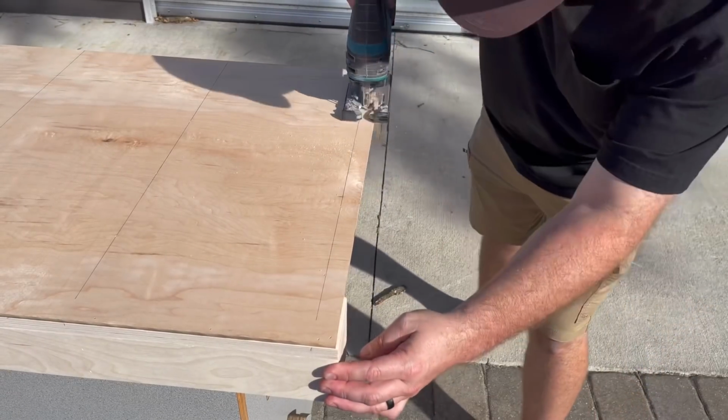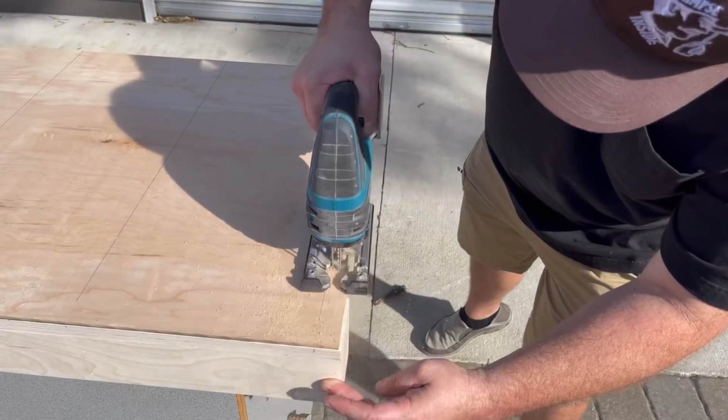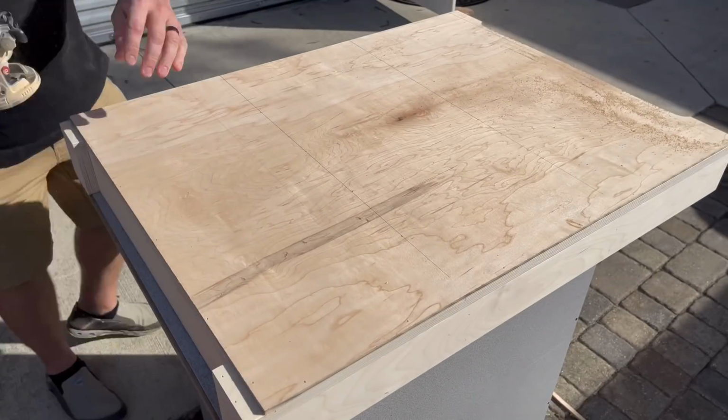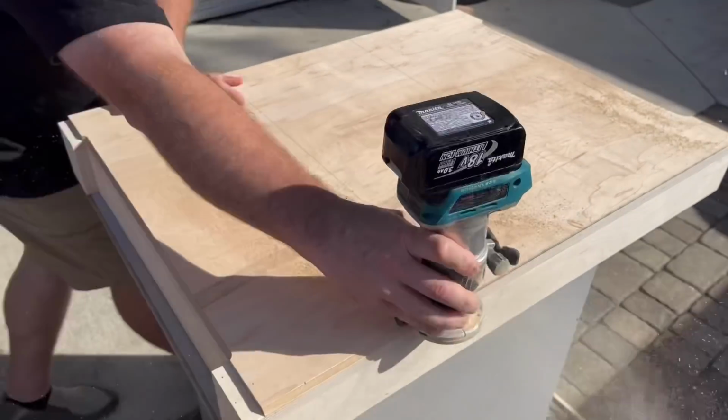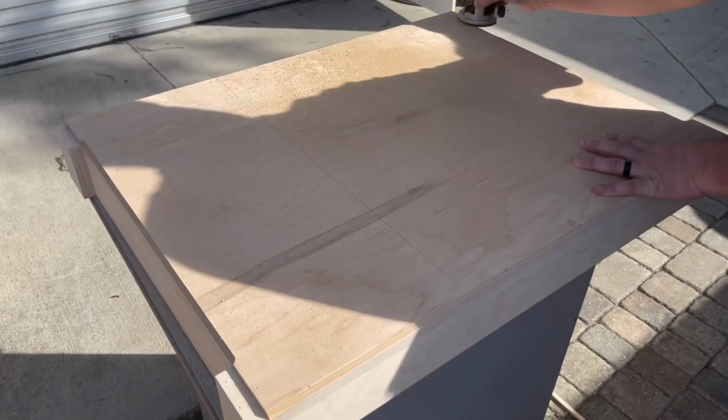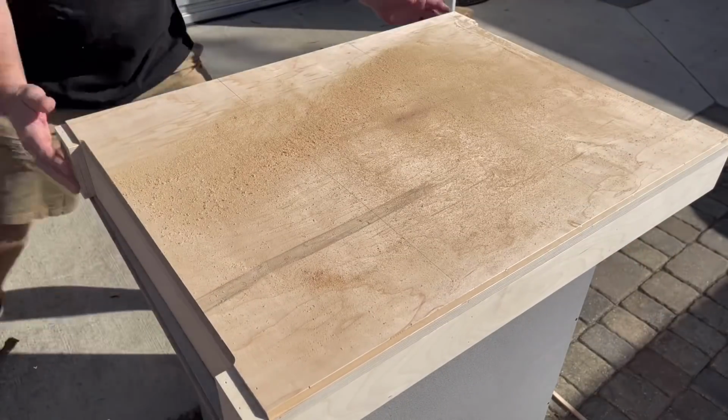So with the 6 panels built and the backs on all of them, I realized I want to flush trim everything around, and to do so, I need a little jigsaw to help me remove some of that 1/4-inch material, so then I could take the chamfer bit that's going to ride around the edges and get everything a nice, even look.